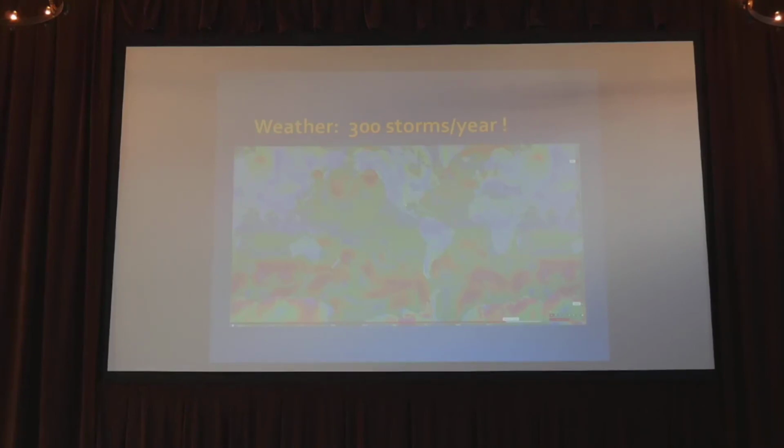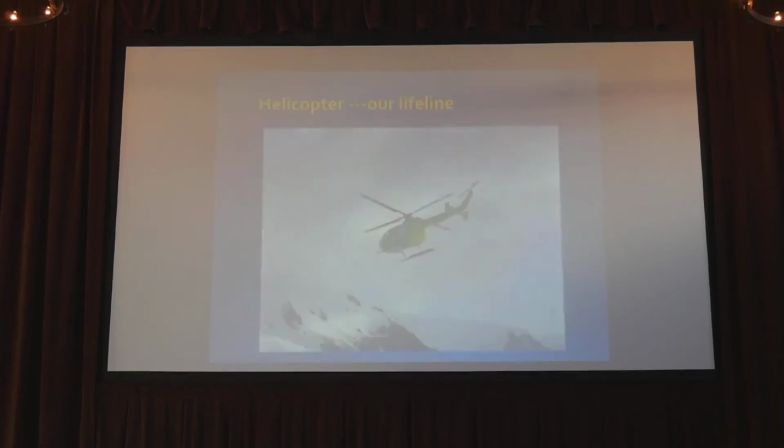Now let's say that they hit a really nice time down there and they're not having trouble with wind and the vertical is playing great. So they go the first few nights and they work all the top level guys, right? Get them out of the way. They can bring the second vertical over and have a 2-element phased array. We've put together a dual vertical array for them that they can change. They have enough radials for 2, and they can actually put up a 2-element phased array and get about 3.5 dB more gain, which would make a difference for a lot of the second tier or the mid-level tier stations.